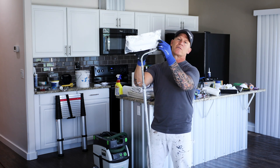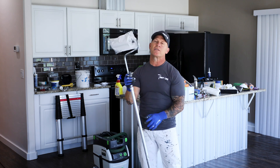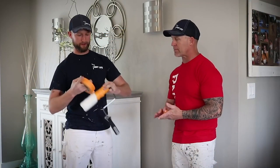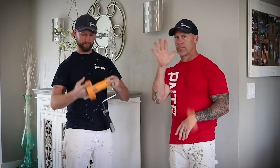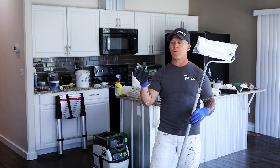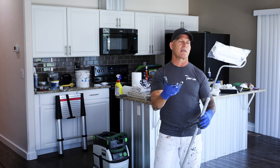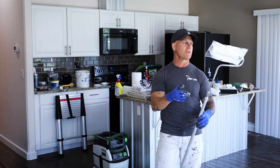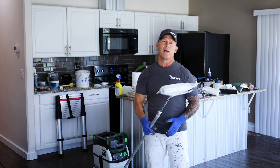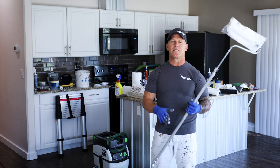It's a great product. The sleeves are perforated sleeves — it's a special sleeve you have to get. You need to make sure you de-lint them before you use them. I have videos showing how to de-lint a roller. Just de-lint it first, because the perforation process causes a lot of lint to come out on initial use. De-lint it, then put it on, and you're good to go.